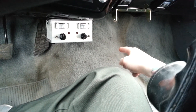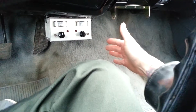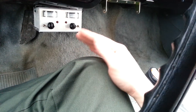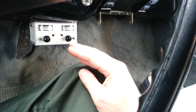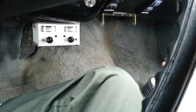When you turn your driver on, you'll be able to look at the main meter and see where it's at. I don't need separate meters specifically — if you've got a 1000-watt RMS slug and it's swinging to 800, you know your driver's working. Shut your driver off, key it, it'll barely move. Shut your big box off, key it, and it'll probably key 100 or 200 watts — whatever you've got it set at. You just need common sense, but I like to have one quality meter so you know it's working. You'll look like an idiot if you think your amp is blasting, talking all big, and it's not even on — I've done that before.